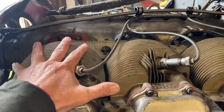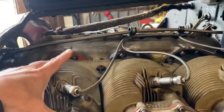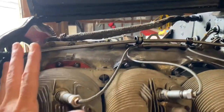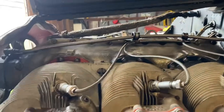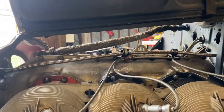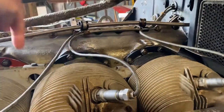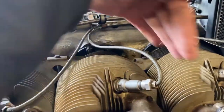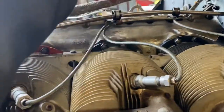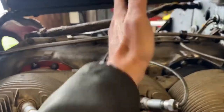The balance on all six cylinders is set to balance. I'm going to double-check and balance the connecting rods, getting them all treated so the system is within — ideally within one gram of each other. The minimum spec is no more than two grams difference per side on opposing cylinders, so it could be up to six grams total difference between cylinders bank to bank, but only two grams between opposing cylinders.